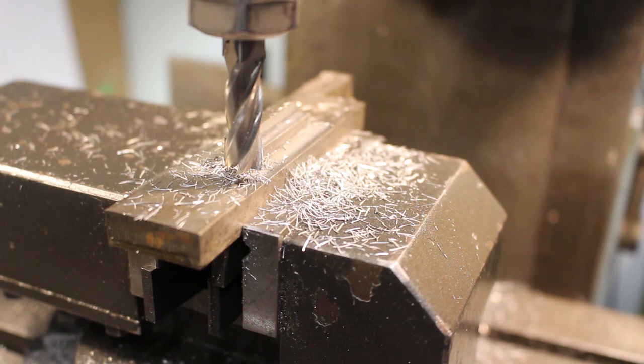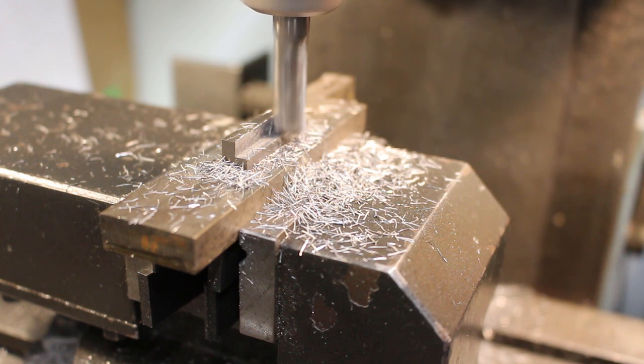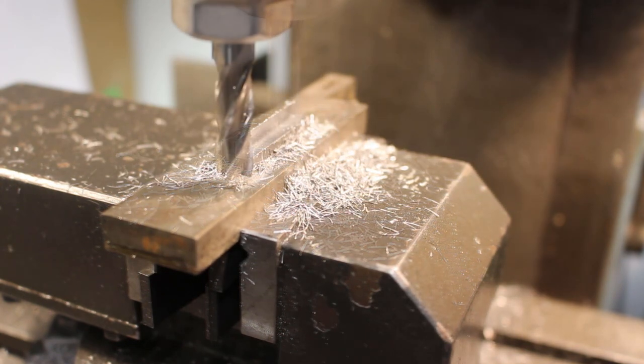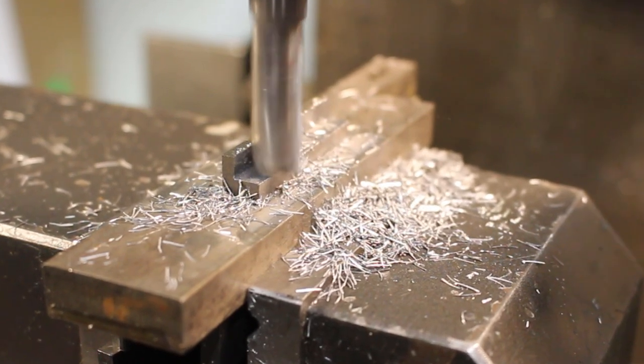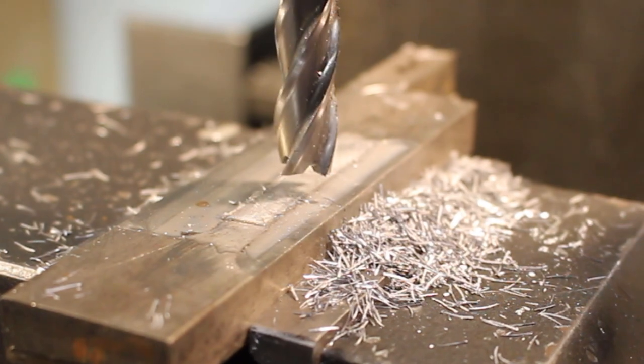So we'll step up the ante a little bit, and we'll take 0.5 cuts, 0.5mm, 20 thou. So here we go. Okay, that's going pretty good. So that's 4mm total depth we've taken in this X direction. So I think we'll go to 1mm depth of cut, see what happens. I think we found the limit.